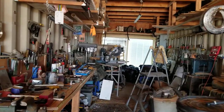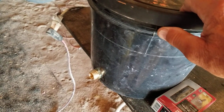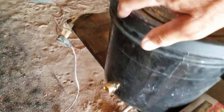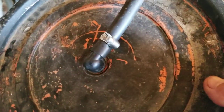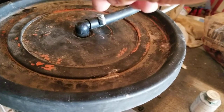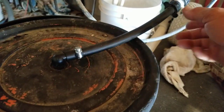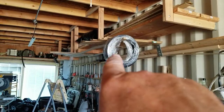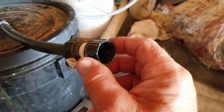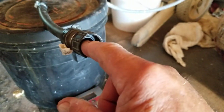A couple of things I've been doing here. Number one, I started working on my Tote Koozie filter system, and I think I should have this up and running by tomorrow. So what I did was I put a half-inch pipe thread elbow fitting, screwed it through the cover right here, and then put a piece of that same hose I used for the hot water solar panel on here, and then a female hose connector so my pump can screw onto that.